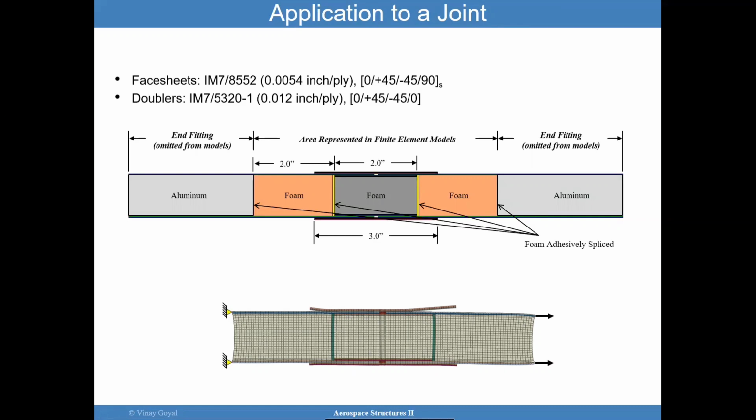I know this is not O-rings, but hey, if a design is bad for the primary O-ring, and I discussed that in the previous lecture on bolted joints, then it's probably bad for the second O-ring. And so you may have redundancy, but perhaps you've screwed up the whole design thinking that you have redundancy, but the thing came apart easily. Just think that you need to pay attention to that aspect in a design. Don't think you have redundancy when the design or the manufacturing process is not good enough, to the point that the redundancy you thought you had is not there. It stinks.